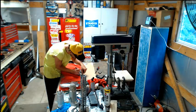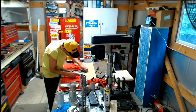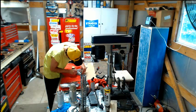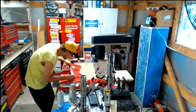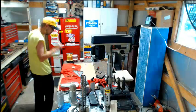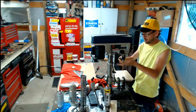So this one right here is definitely going to get one. Well, we got halves. That is a half inch. And then let's mark it down here, half. And then we'll scribe it. So we'll have one there, one there, one there, and one there. And then that will be a center. And that will be a center. There we go. Now we got her under control. We'll put four on the bottom. That'll give it a little bit of ergonomics. And having four on the bottom, you'll have more holes for heat to rise through.